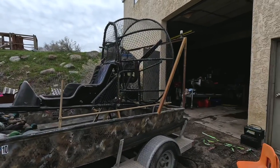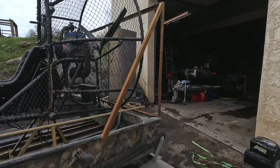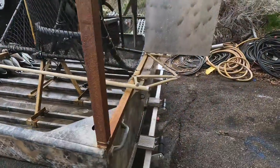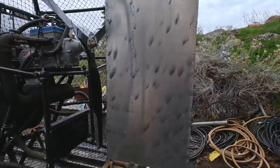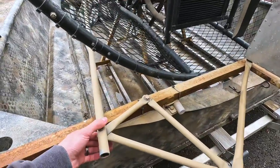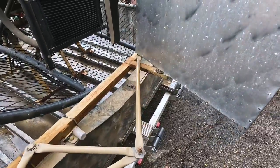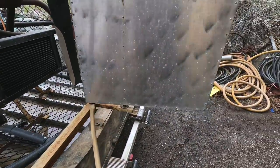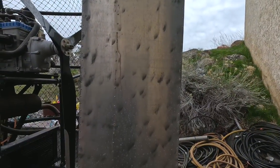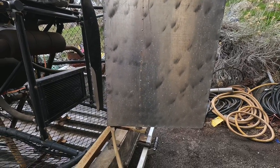Mounted inside here, really easy rudder frame on it. We just build a square frame, separate of the powered parachute, mounted in the boat a few spots here. Put the rudder on it. Steering linkage is just solid, just loosely bolted here and double nutted to keep it on. You can see it's a push pull. Worked really good for it. Single rudder kicks this boat around fine. The rudder is a 2 foot by 4 foot, and we offset it just 1/3 to help kind of push it back or give it some power steering.